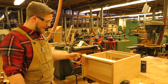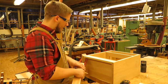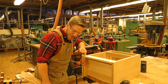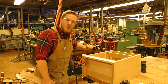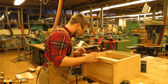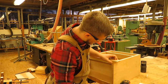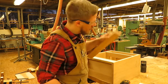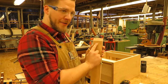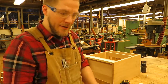We've made the side molding, the front molding, and the front filler piece. What we're going to do now is clamp one side molding piece perfectly flush so the bottom of the miter is flush with the edge of the case. Then take the front molding piece, line up a perfectly closed miter on one side, come to the other side, mark a line at the very bottom end of the miter we need to cut, carry that line across the edge, and go to the radial chop saw to cut it down.